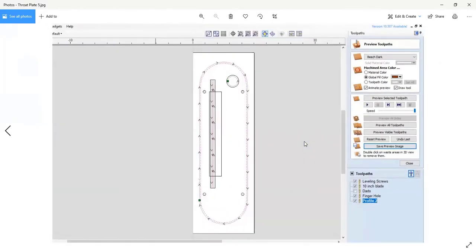And so here's another. This is the tool paths being shown. It shows the direction that the tool is cutting. The red line is what we're actually cutting on the outside perimeter. And you'll notice that the line with the arrows on it is slightly offset to that. That's showing me the center line of the bit, so I can make sure that I've got this aligned properly. I don't want to cut on the line. I want to cut with the edge of the bit on the line. So the center line is offset. This is all just part of the preview process that allows you to see before you cut any stock whether or not what you're doing is probably correct.